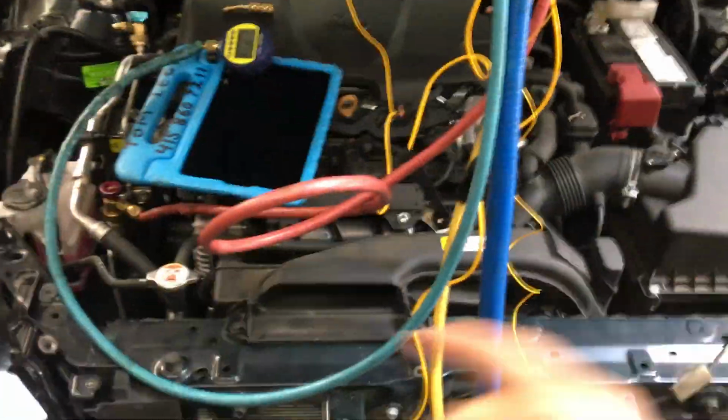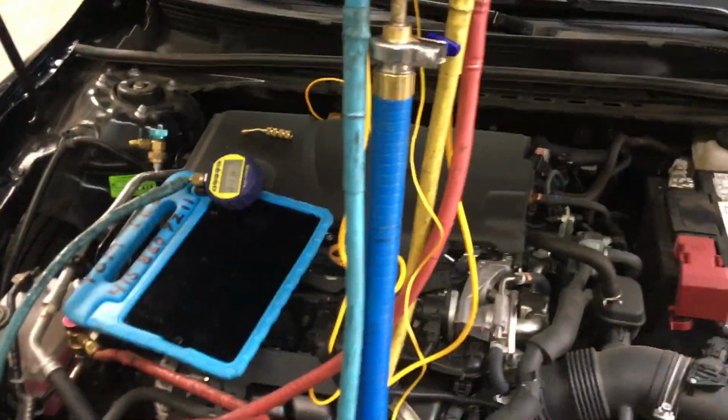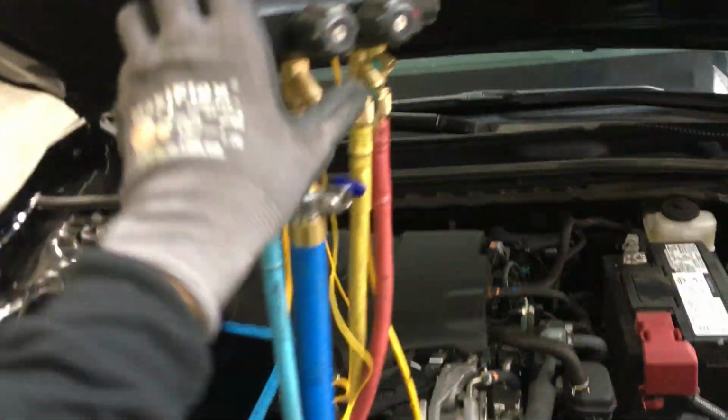Okay, so now we're going through a refrigerant hose that you would never even attempt, and I have to stress this because unfortunately people believe that you can do a vacuum decay test through refrigerant hoses. You're mistaken. You maybe accidentally misunderstood some wording that was put on the internet. Okay, so let's open this up.